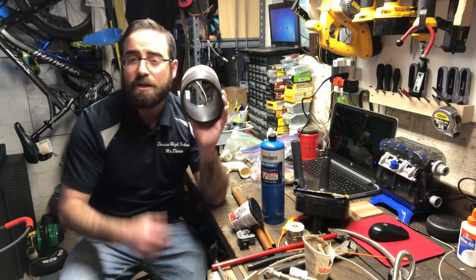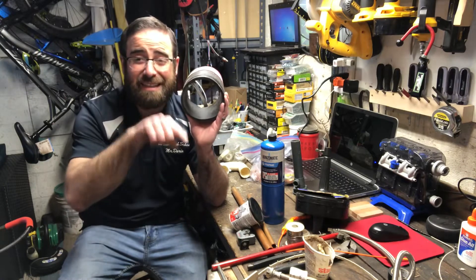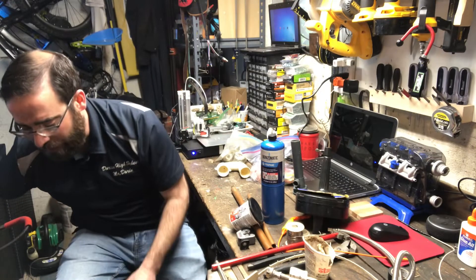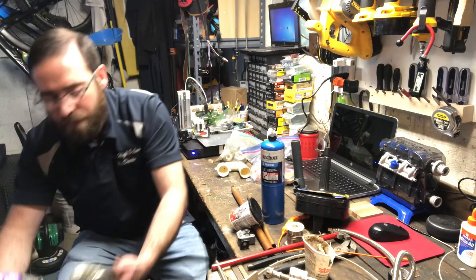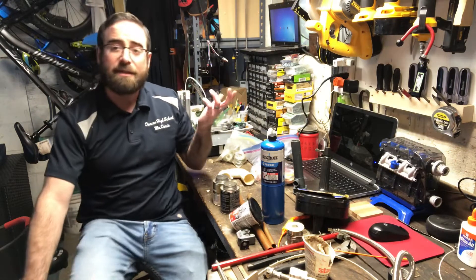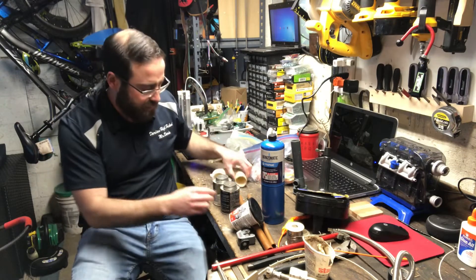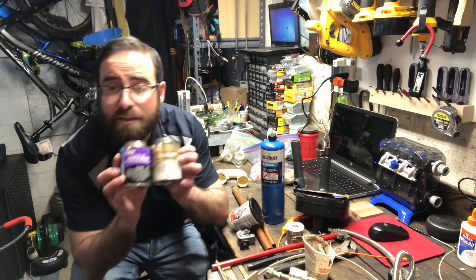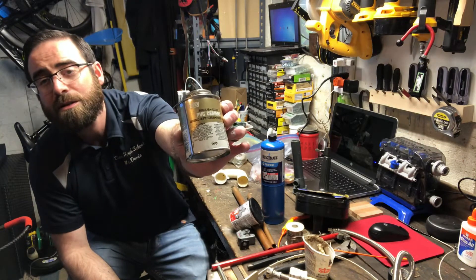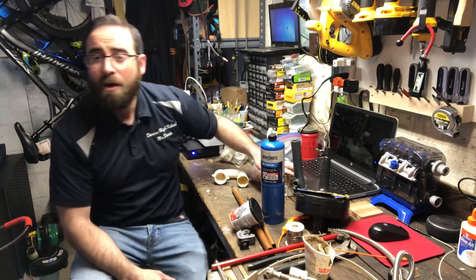I also have a large PVC coupling for connecting a large PVC sewage line if you had a cut or needed to get at a clog — you can seal it with this and some hose clamps, but I'd wait and buy that when you need it since it's a rare repair. Speaking of PVC — this is PVC primer and PVC cement. When PVC pipes don't have threads, you glue them together: the purple one is a primer that cleans the pipe, and then the cement glues the pipes together to create a watertight seal.